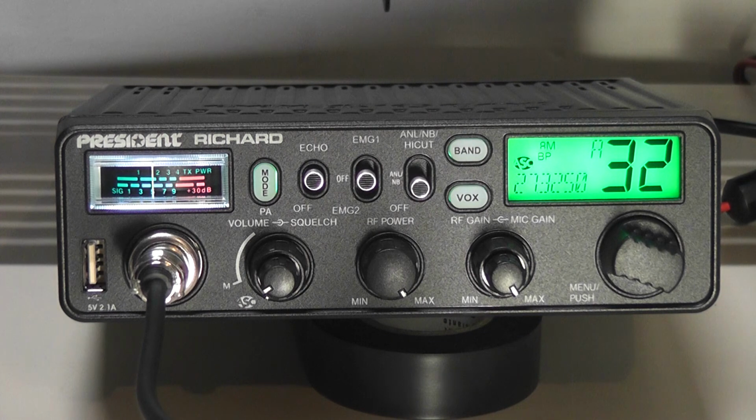Now, when I went in and changed that modulation number up higher in the engineering menu, increased the modulation, things changed. AM 2.8 watts with swing about 10 watts. On high power, 15 watts, swinging 50 watts. So with that little bit of modulation boost, power came way up, which is super impressive for a tiny little radio, 7 inches wide, 8 inches long, smaller than most old school radios you guys have ever used.